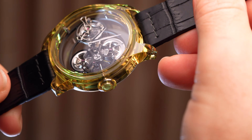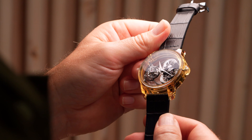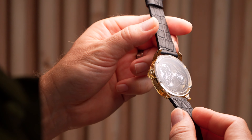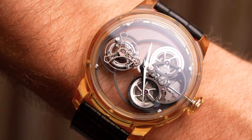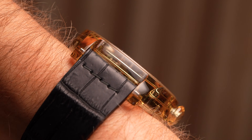At 17mm in diameter, it's about 50% larger than most other tourbillons, and it beats faster at 4Hz for a smoother sweep. Throw in a 72-hour power reserve thanks to the dual mainsprings, also easily visible from the dial, and you've got a highly practical tourbillon watch which shreds its competition.